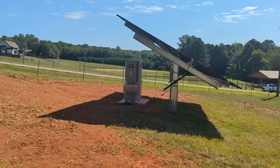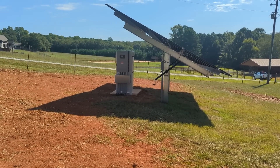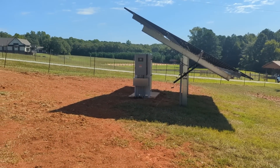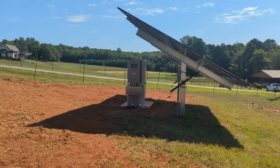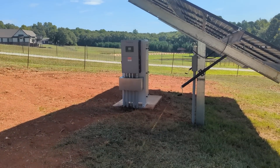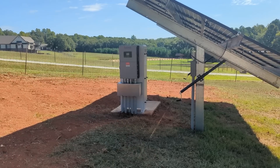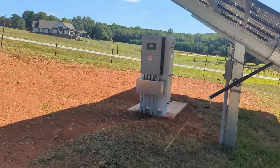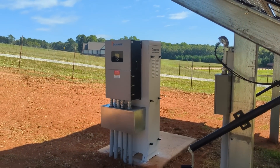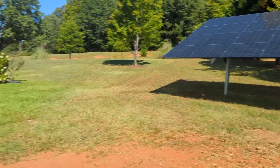In anticipation of new battery codes — NFPA 855, IFC 25 — and however they get integrated into the National Electric Code, we're getting ahead of it. We're not sure exactly how it will all come together, but we may find out more at the Anaheim conference after sitting in on some code sessions. We just thought we'd get the batteries and inverters away from the home — we didn't even have to go inside the home to make this entire system work.